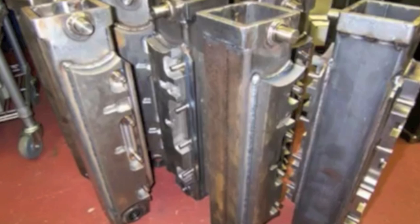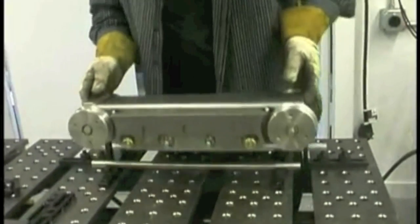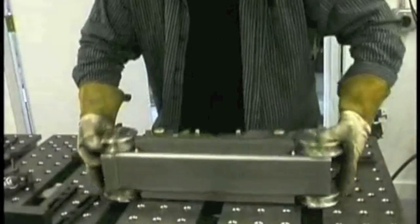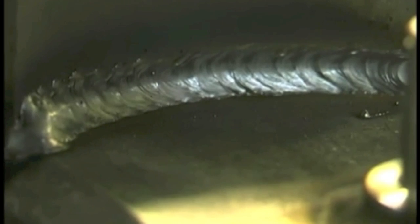The CO2 worked just fine, but it reminded me of a time when I was welding about 20 of these remote sewer crawler tractors. The side plates on those were much the same — they aren't just balance weights; they actually serve a purpose with little guide rollers and everything. One time I ran out of MIG wire and didn't even have a stick welder at the shop, so we were scratching our heads on how to finish up the last few. If I'd had a stick welder, I could have welded those side plates on with no problem.